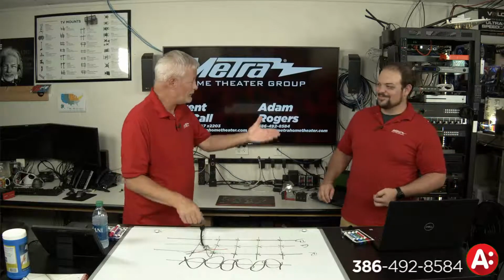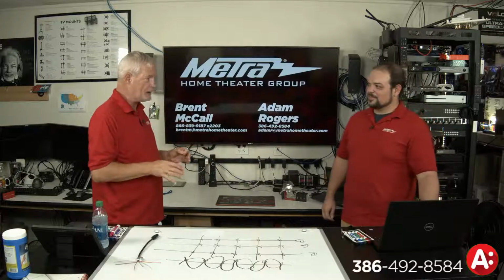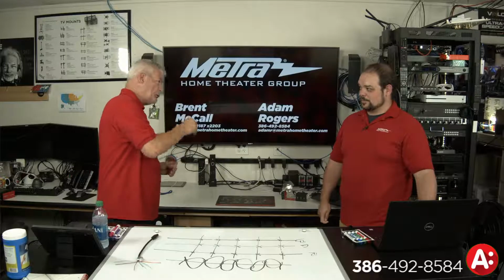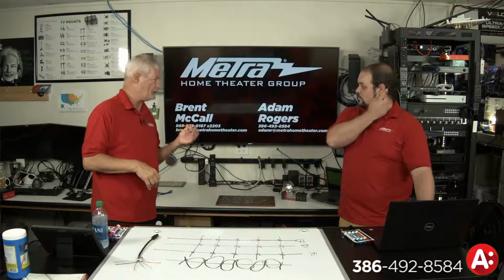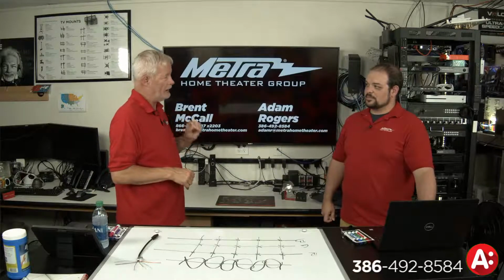And in fact, you mentioned the network cables. HDBaseT understands very much how to deal with the timing issues between blue, orange, green, and brown. That's why they give you either 568A or 568B option. And what is the difference between A and B?